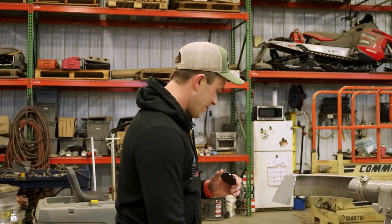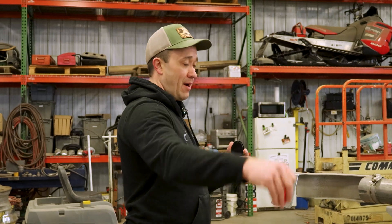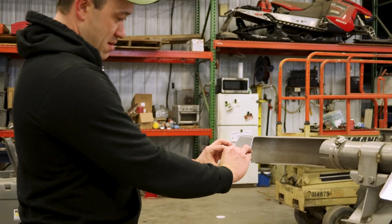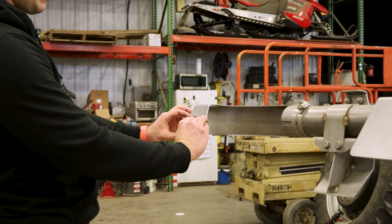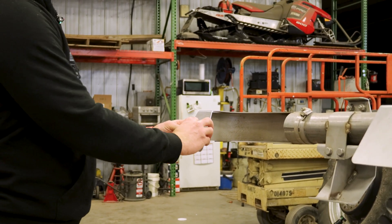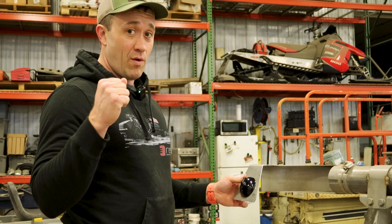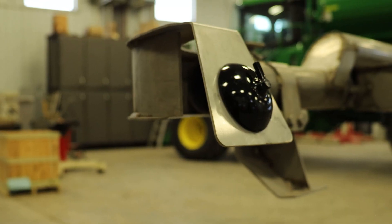When you're sticking on these sensors, it's really important that it's clean. We've already gone through and put the brake clean on, Garrett wiped them down. You peel off the adhesive, take the sensor, center it up as best you can, put it maybe a pinky's width up from the bottom, have the port for the auditory tubing going out the top, and stick it on there. The next most important thing after getting it clean is you push it on there with a little bit of force — it's pressure-sensitive adhesive, so pressing activates the adhesive.